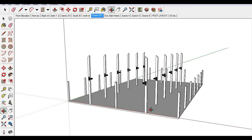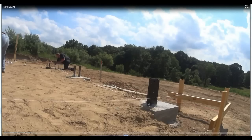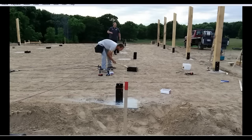The U-bracket attaches the post to the concrete — I'll show a picture of that right here. You can see the U-bracket attached to the concrete. These U-brackets are very strong and they'll hold that post in its proper location without any bracing. So you can put in all of your posts once you get your U-brackets in the correct spot. In this picture you can see we have installed our first row of posts and we're beginning to install the second row.